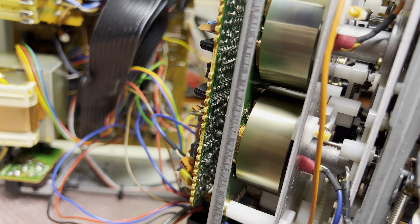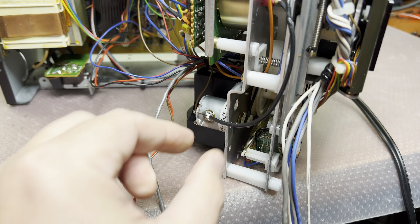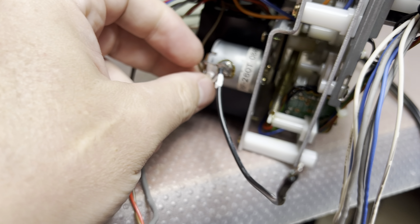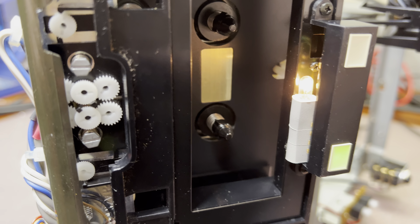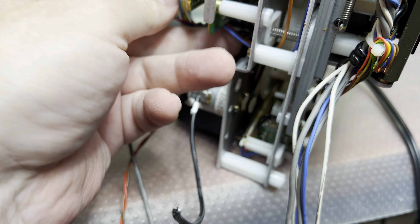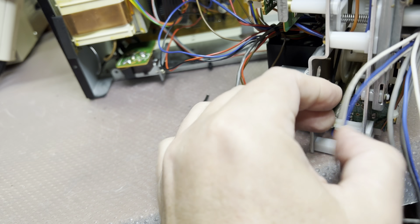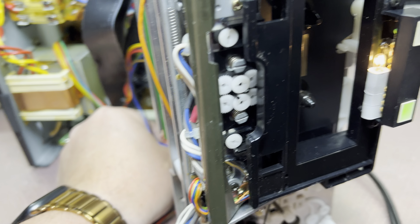Now the right side — okay, it's reversing, working good. I can see fast forward, rewind, fast forward, stop, rewind all work, but the common gear motor is not running. I believe it's because the ground is not connected. Let me get the ground — yeah, heads up, we're running good.